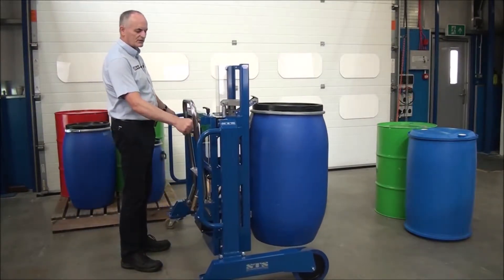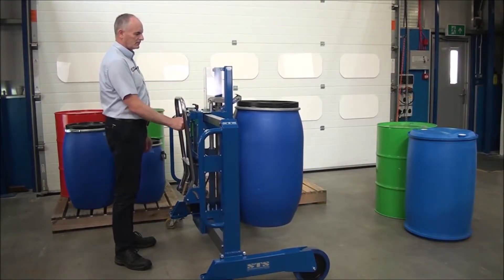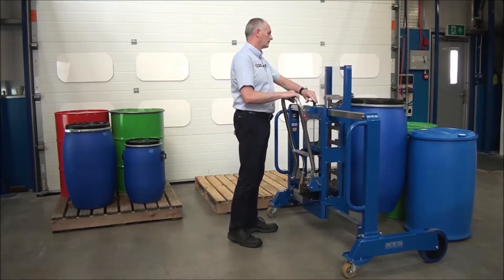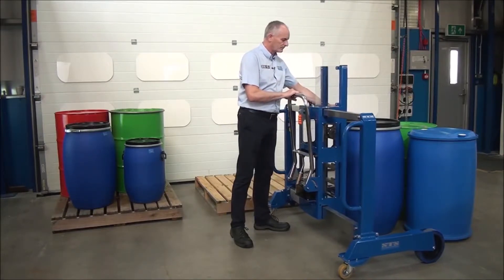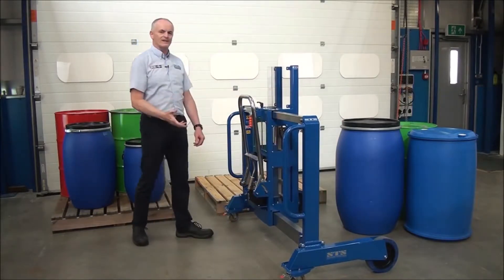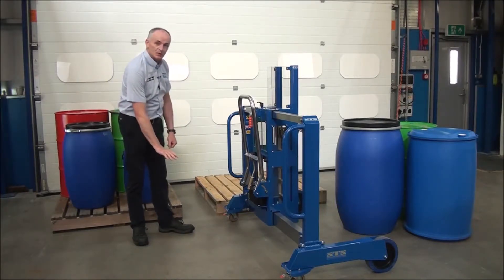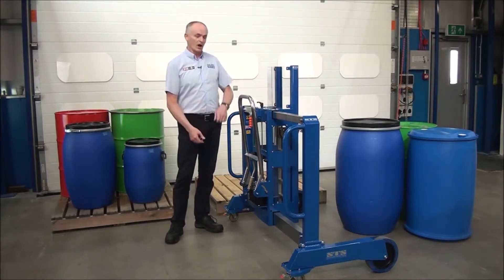We can side shift to the middle, wheel it forward, and as soon as there's no weight on the drum we lift the catch and go back. It's a very easy way to eliminate manual handling of drums. We can also set the catch at different heights — for example, we can handle 50-litre small drums, take the lid off, even take the lid off a Mauser and pick it up, and also open-top drums.